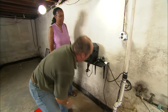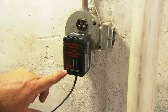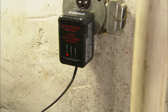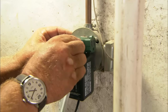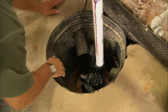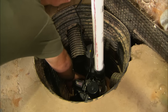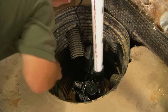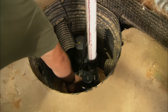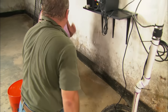That is the last of our low voltage connections. Now we have a couple of line voltage connections: one is right here - the battery charger. You can see this power going in, it's charging, and once the battery is fully charged you'll see it with this indicator light right here. The other is the 110 volts going down to our primary pump. Now let's test it. Imagine it's raining, water's coming in through the French drain, the water level rises, the float comes up - pump is on. Now let's test the backup: the lower one fails, the water continues to rise, and the upper float switch engages. The pump is on, and you can also hear this really annoying siren - which you can disable - that's designed to tell you that you're in backup mode.